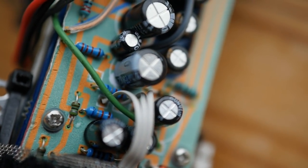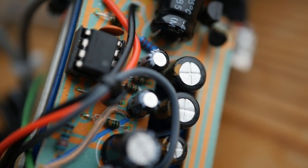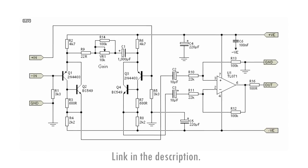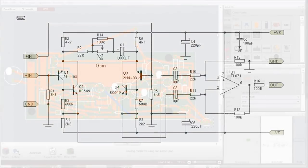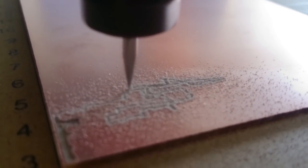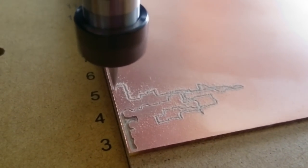These had to be made from scratch because the commercial options were either too noisy, too expensive, or too large. Thankfully there was an excellent schematic for a low noise preamp over at Elliott Sound Products, which I modified slightly to also provide phantom power to the microphones as well. Designing the PCBs for these was super easy thanks to a free piece of software called Fritzing, where it was just a case of rearranging the components into a sensible layout. I then used a CNC — about which my next video will be, by the way — to etch out my design onto a circuit board blank, which was then populated with components.